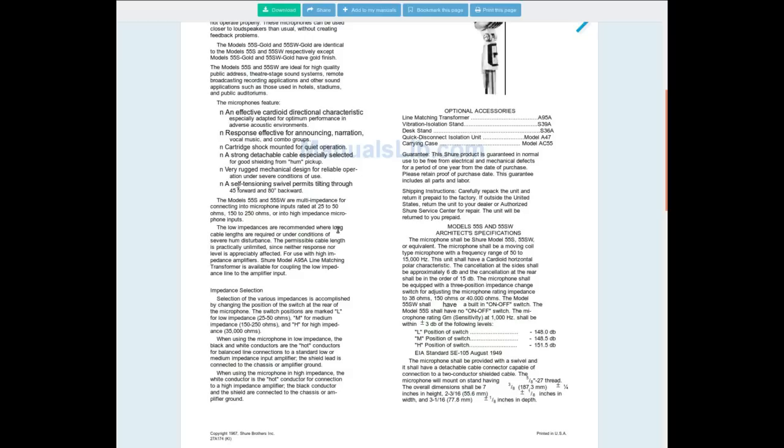Also, a lot of earlier condenser microphone preamplifiers — to get the phantom power on — would use a center tap on that transformer. That way they could send the power out to the microphone through the center tap and get the same positive voltage on both pins two and three, and ground would be on pin one. That would isolate the phantom voltage from the grid bias voltage on the first tube input stage. Of course nowadays, since almost nobody's using tube preamplifiers, that's not really done.